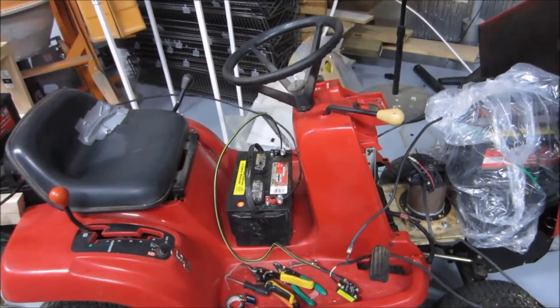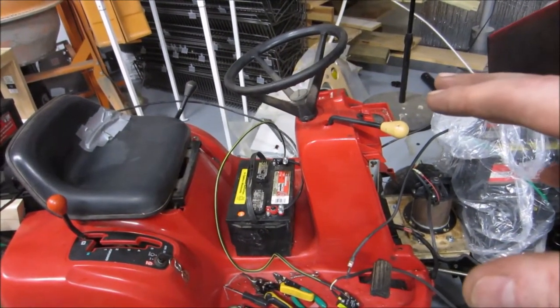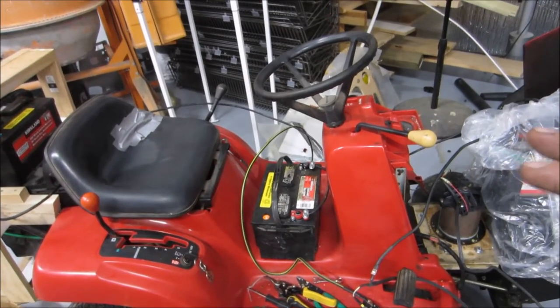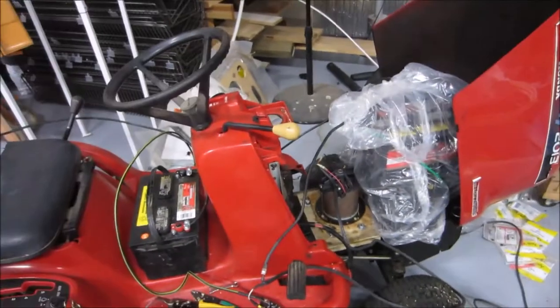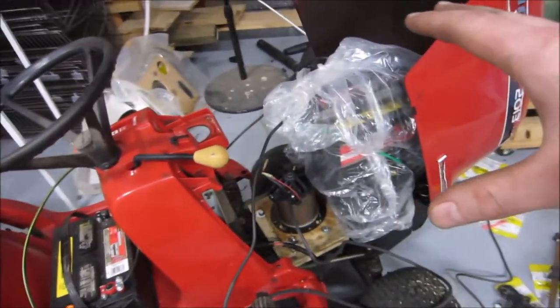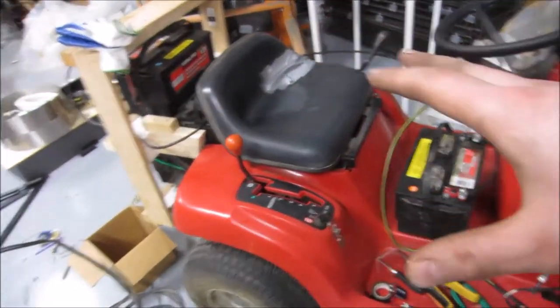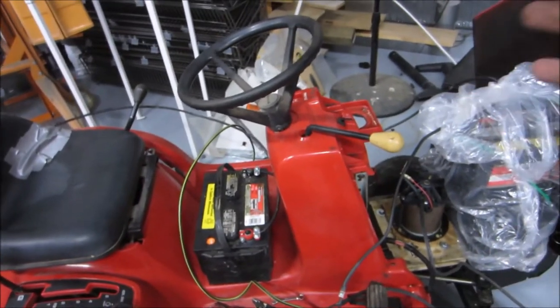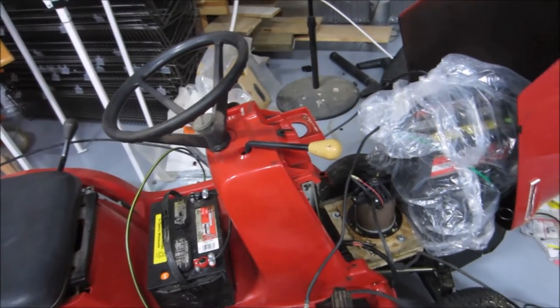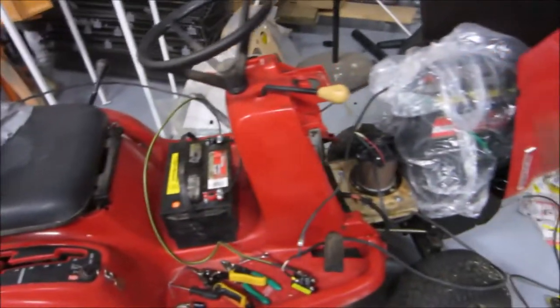I had added distilled water to some of these to try to recondition them, and that did actually seem to help. So some of them, it was just an issue of dehydration in the cell, but some of them just really didn't seem to recover at all. And by no means are all of these perfect. They're lucky to hold a 10.5 volt to maybe a low 12 charge, something like that. But I figure between all of them, it's enough to drive this vehicle for a while.